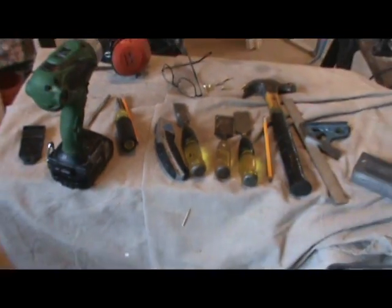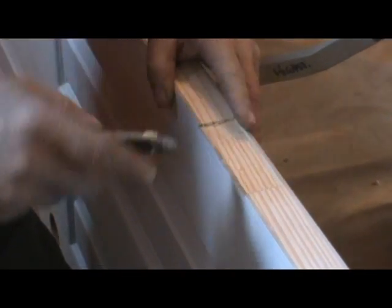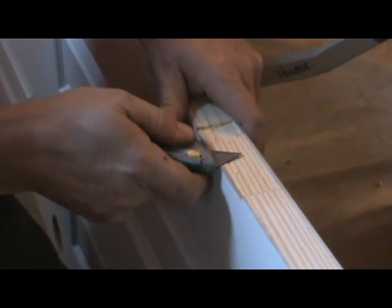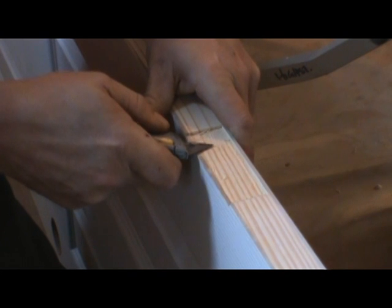Here are some tools of the trade. I always like to line everything up like it's a surgical palette, including hearing protection, glasses, you name it. Right now what I'm doing is cutting out the hinges, and we're doing the 7-11, which is always the key. 7 inches from the top and 11 inches from the bottom.